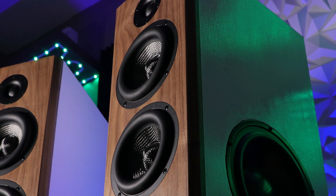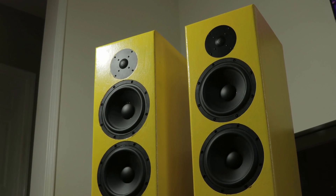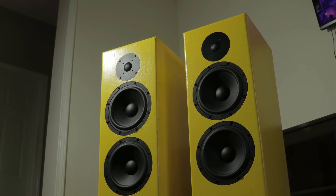People are going to ask why I chose the tweeter at the top with the two woofers on the bottom rather than a woofer, tweeter, woofer arrangement. There are benefits both ways. Some people prefer MTMs, some prefer TMMs — there's really no wrong answer, it's just a design choice. I chose a TMM because I think more people are used to seeing the tweeter on top, I think it's typically easier to position at ear level, and I also created a speaker called The Uglies not too long ago that everyone loved and wanted to see a smaller version of — this was my chance to make a mini version of The Uglies. But really, it is just a design choice the designer has to make. You could absolutely create this as an MTM, but you would have to change the crossover.